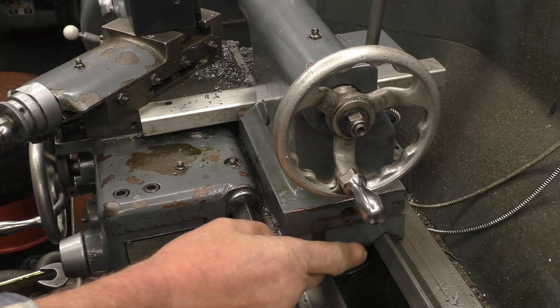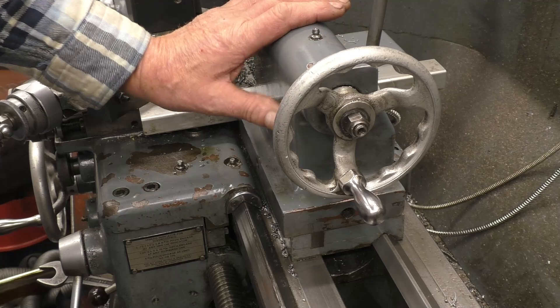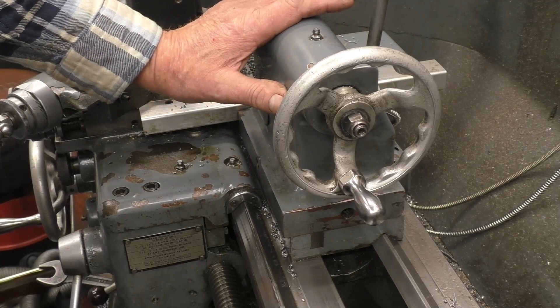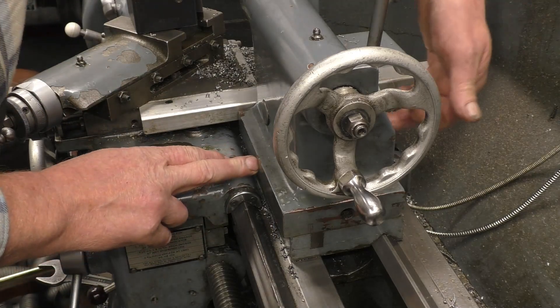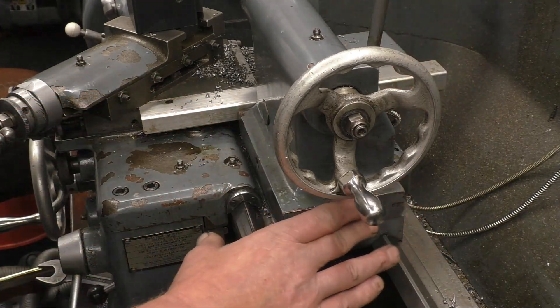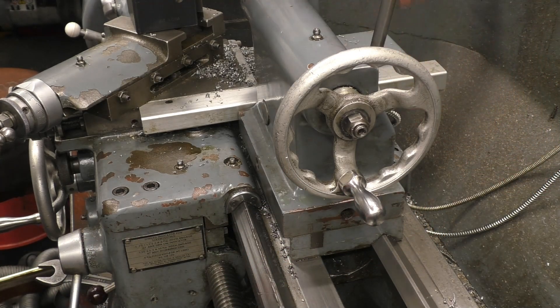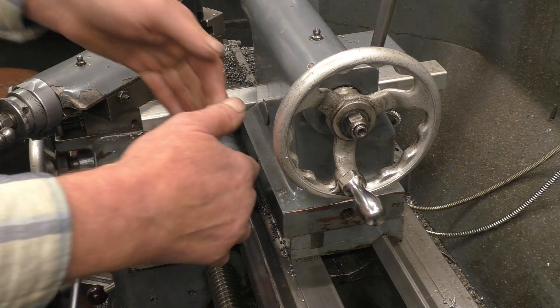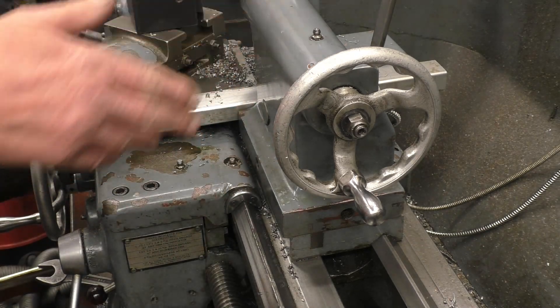There's actually a scribe mark on here which lines up with the scribe mark when it is lined up, and that gets things reasonably accurate but not accurate enough. It's adjustable by two cap head bolts — one on that side and one on that side — which push against a central position, and this moves back and forward on some dovetails. The big clamp handle is the thing that stops it moving. So obviously it's way over because we were doing taper turning, so it needs to go across that way.